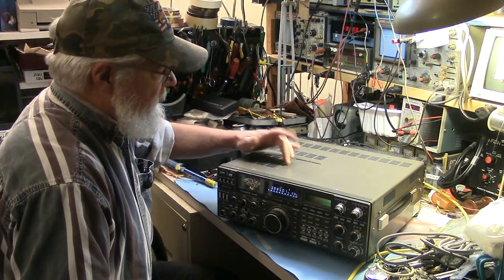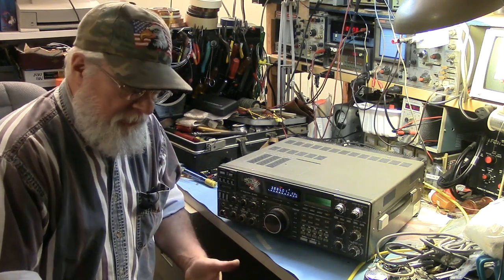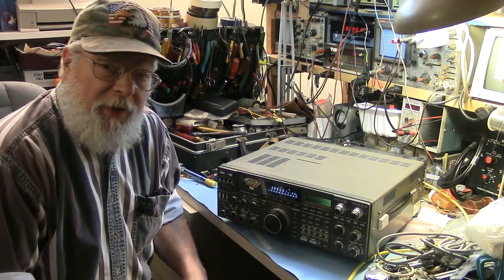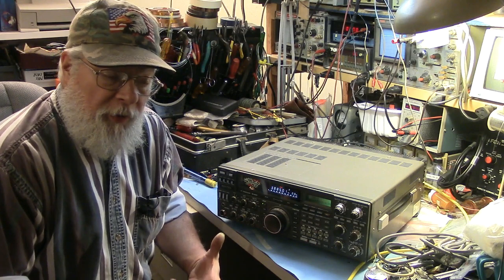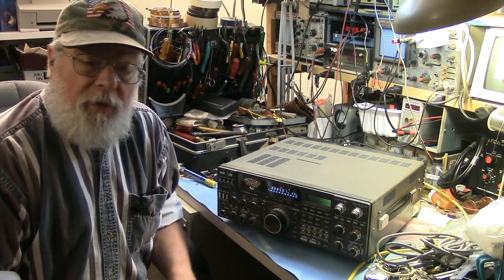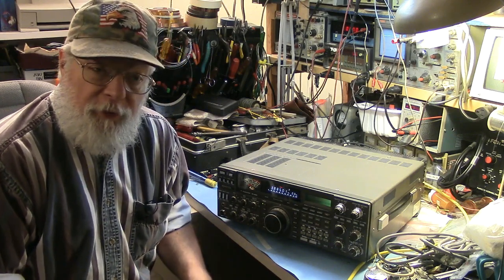And there you go. Now it's interesting to note from the service manual that as much as I do like Kenwood, they really didn't have enough information for my liking. The only information that was really valuable was looking at the actual shadow diagram of the circuit traces of the actual PC board, and I immediately saw that a ground trace to the VOX switch, as well as the meter lights, had no apparent path to return to ground, other than a trace on the board with the screw. And well, I showed you the screw, so there you go.